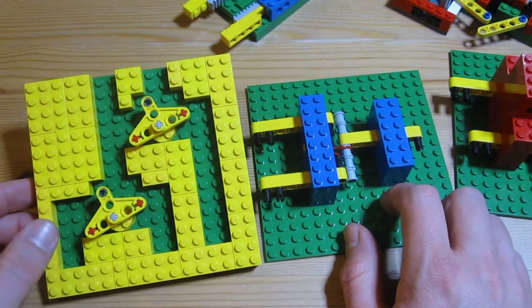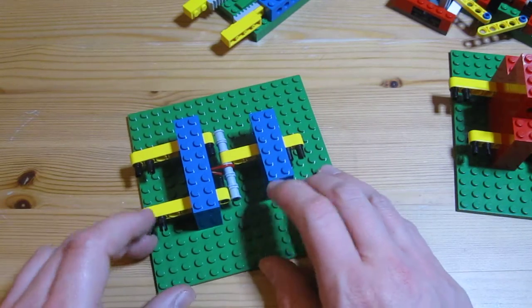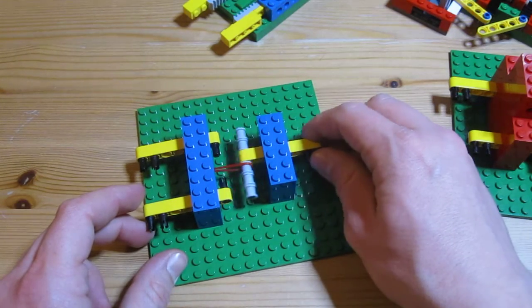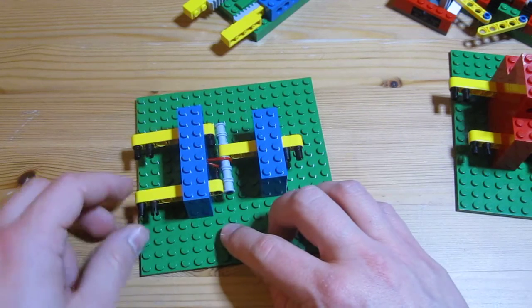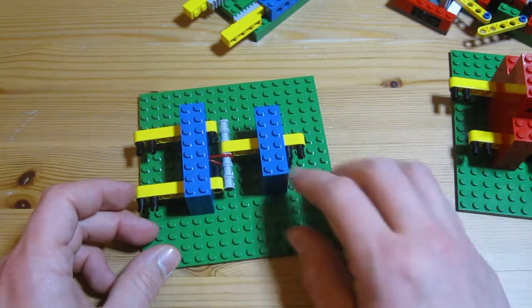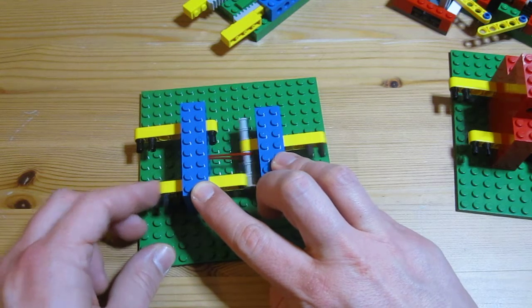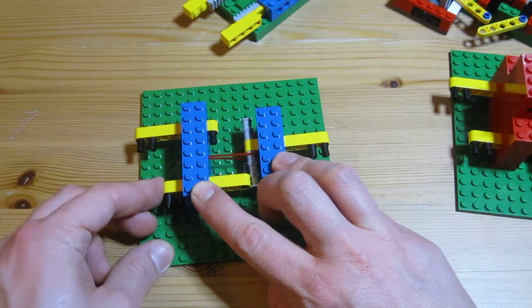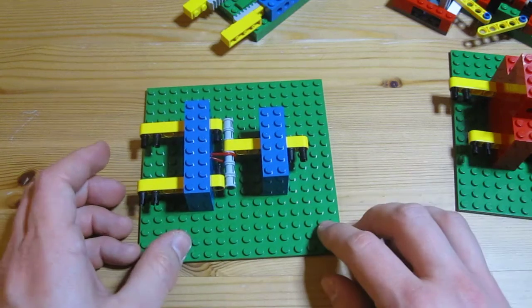Along with this ball-run sort of logic, I was quite keen to make logic that was all lever-based. I had this idea that if I had a bar that moved independently of the two inputs, I could make a simple OR gate. If this is back here it's off, and if I push it through it goes on. You can see that carries through the output — both off there's nothing, one is on you get one, both on you get one. So that's effectively an OR gate.